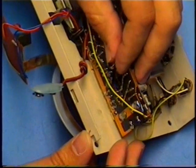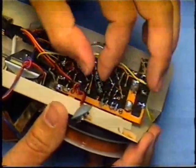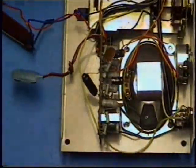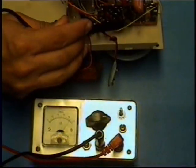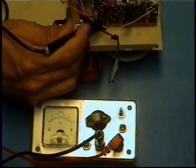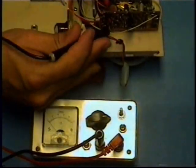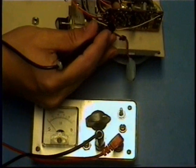So here's the circuit board in the white Apollo RA-11 with its old capacitors. Very basic looking board and old capacitors on it. I'm going to just go in with an ESR meter and see what they're like. Just this one here, you know, probably going to be not so good. It's not bad. Okay, that's good to know. About this guy, it's all right. Okay. What about this guy down here? It's okay. Well, that's good. This guy right here. Fuck.